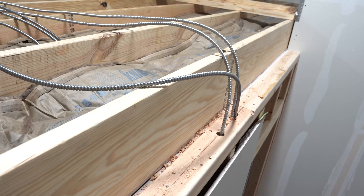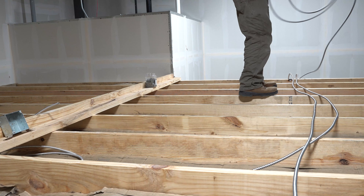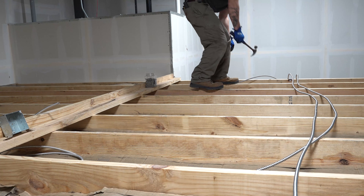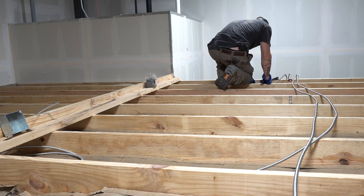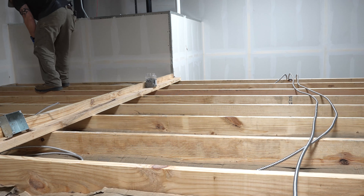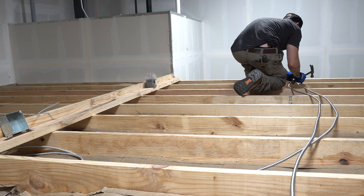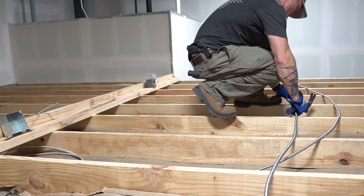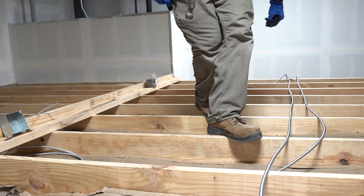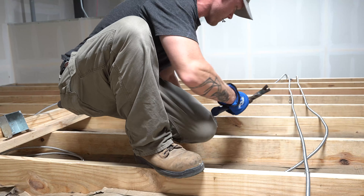I have three potential lighting zones I wanted to get run. I've got some colored LED strips to mess around with, the overhead cans that help outline my silhouette on camera, and some lights out front to light up my face. I ended up running three different switch legs to three different locations. One is for the cans I just installed below; the other two I just put junction boxes for the time being because I still don't know what I'm going to do with the lighting until the space is painted. I start going down and stapling all of the MC, stapling every four feet, and leaving a couple little loops at each location for slack.